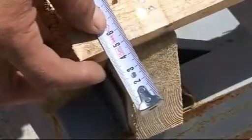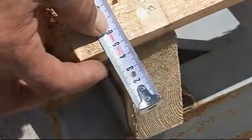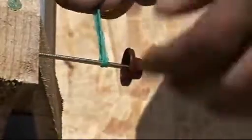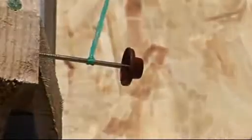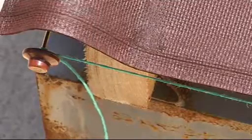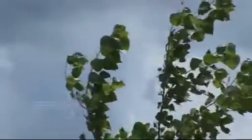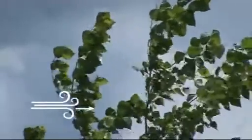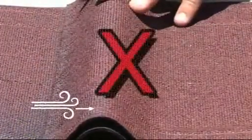To ensure a proper alignment, a guide rope should be used on the eaves. This will align the tiles correctly and prevent any protrusion more than 5 centimeters from the eaves. The first row of tiles should be applied by leaning to the guide rope. Before placing the tiles, the direction of the prevailing wind has to be determined. Tiles must be placed in the opposite direction in order to protect the overlaps from wind uplift.